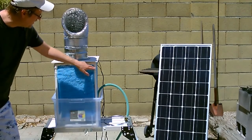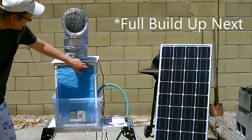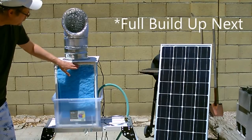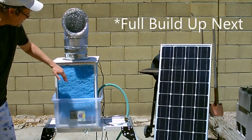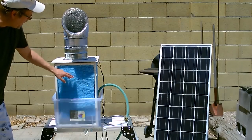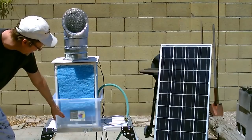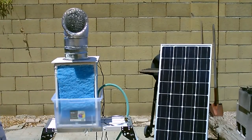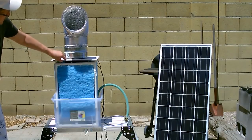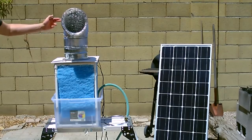Quick recap on the build: it's a cube style with half-inch pipe and three-way couplers on each corner. Holes drilled underneath — about eight or nine of them, spaced three-quarter inch apart, one-sixteenth inch diameter. Pads on all four sides, about 15 inches long. A little water pump in the bottom pumping the water through the frame and down through each of the four pads — you can see it coming out at the bottom on all four sides. Then a small radiator fan underneath this board, pulling air up and out equally through all four pads and out through the vent.